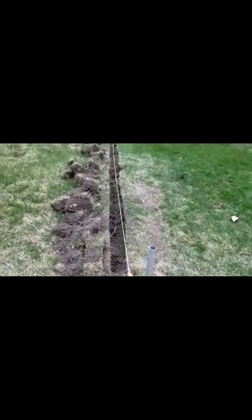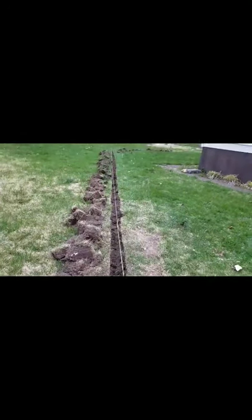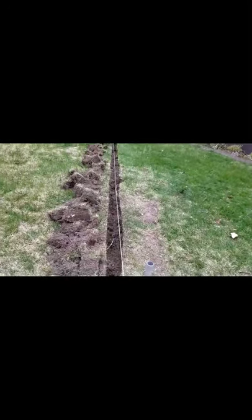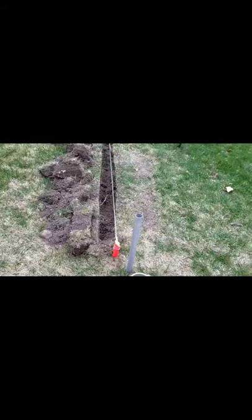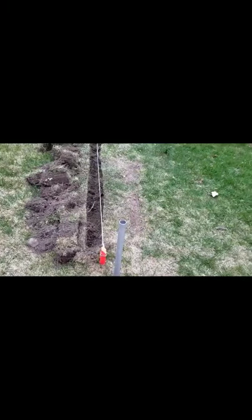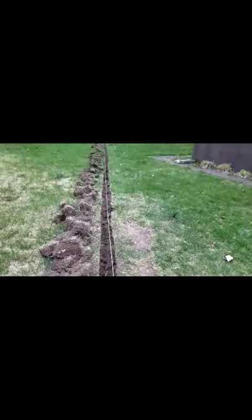What also needs to be done is the trench from the antenna to the house. In this case my trench is about 90 feet long. I'm using a trenching shovel, but it's very difficult cutting through the zoysia grass here in New Jersey. What I do is cut the sides of the trench with a machete, and once the rhizomes have been cut, the plug of soil digs out very easily. It's coming along — about halfway done.